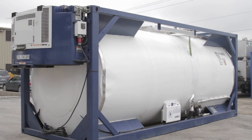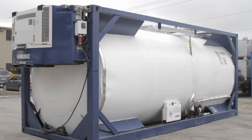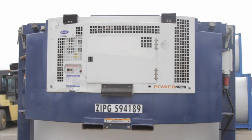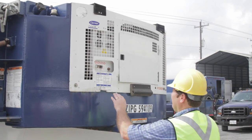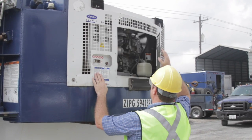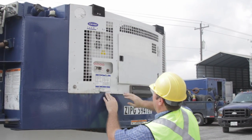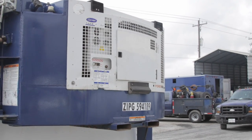In the event that suitable electrical power is not available, Tank Servicing can also supply a diesel power generator set. There are different options available with gen sets, but most common are either nose-mounted onto the container itself or mounted onto the chassis trailer carrying the tank. If a gen set is supplied, the complete system can heat the contents of the tank without house steam or house electrical power. Pretty cool, huh? Or maybe we should say pretty hot.